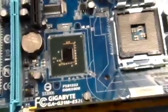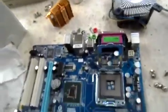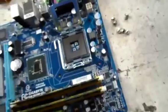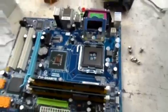It's very small. One thing I might try with this, since this is a scrap board, is get the heat gun out and have a go at removing these chips, because you can get them off using a heat gun since they're all surface mount. I've actually done it with the old eMac board. I was able to get the processor off that just by blowing over it with a heat gun till it gets hot, and you give it a good rap with a screwdriver and the whole processor comes off. Not full focus, I don't know why it's gone all blurry like that, but anyway. I suppose the next thing to do for now is clear all this off and get the case ready to get its new board in.